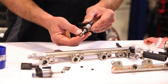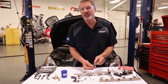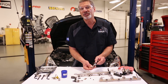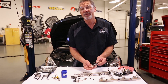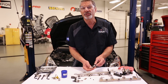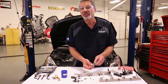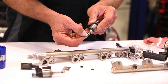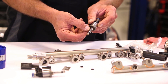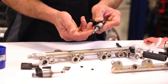This seal is extremely critical since it has to hold back the pressure and temperature in the combustion chamber. Pressure can go as high as 1200 psi, and of course the temperature — you're dealing with combustion fire, so it's extremely hot. If this seal were to fail, the combustion gases could leak alongside the injector and eat a channel into the aluminum head and destroy the cylinder head.